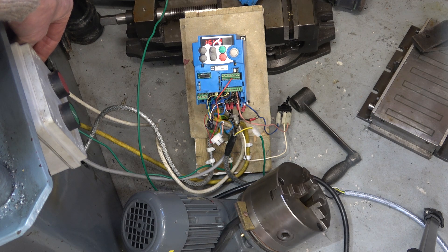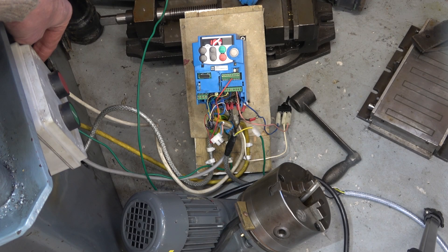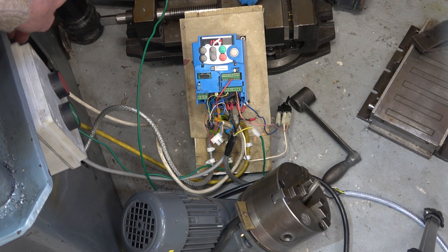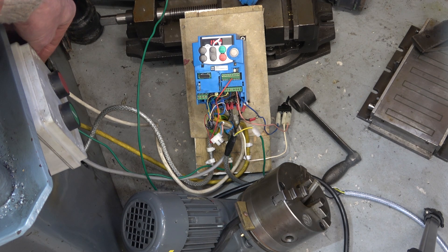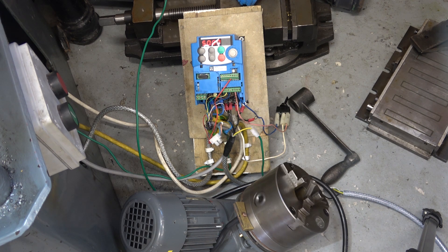Let me take it down. At about 5 Hz, let's see how low we can go. That's just under 3, that's 2, 1.8 — and then it becomes unreliable. It stopped there. 1.5 Hz I can run down to — look, it is still turning. 1.5 Hz. So that's the difference between these two inverters — we were down in the half RPM territory there. I'm not sure the motor would have any useful torque at that speed, but you can see the difference.